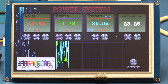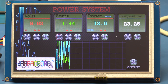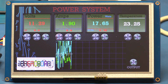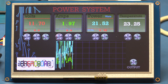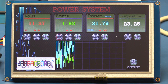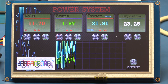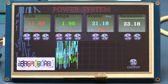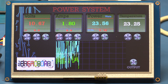I started this project with an Arduino Uno — in a previous video on Nextion displays, I was using an Uno. The problem was not running out of program space but running out of RAM due to the many parameters and strings for the display, so I had to switch to an Arduino Mega. The Uno is fine for simpler projects; I'm only up to about 25k of flash but 3k of work RAM, which exceeds the Uno's 2k limit. The Mega has 8k so there's plenty of headroom.